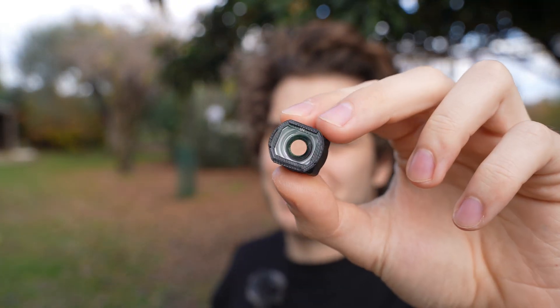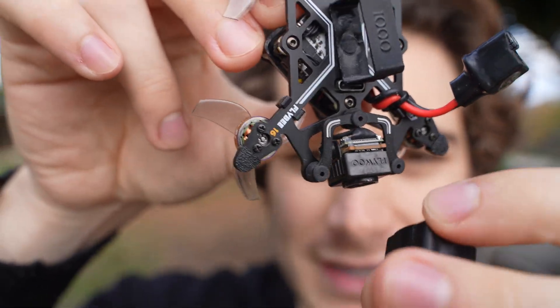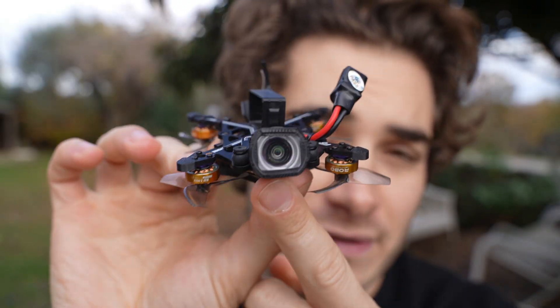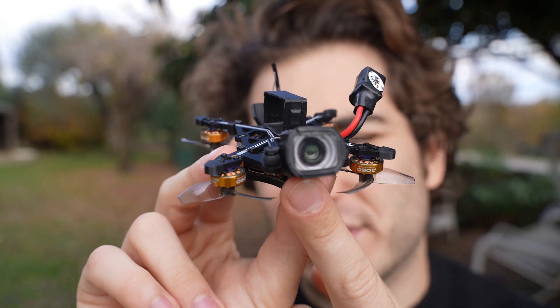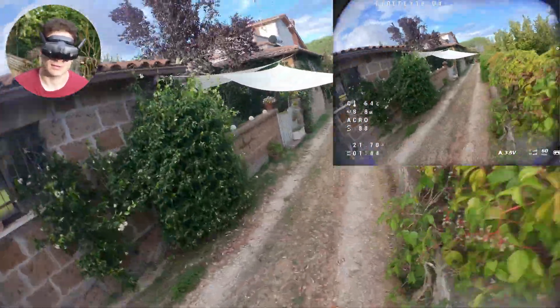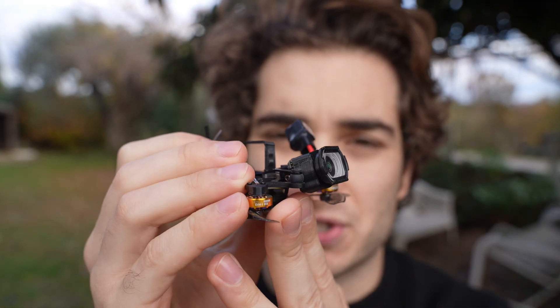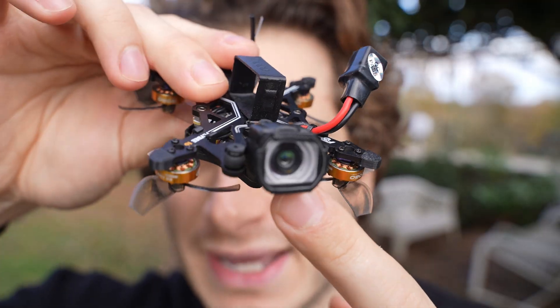FlyWoo already tried coming to the rescue earlier this year by creating this 3D printed wide camera lens adapter that slides on the FlyWoo mount for the O4 light, giving you 155 degrees of FOV. I made a review about this accessory a couple months back and found it was working phenomenally — the wider field of view was incredible — but it introduced a couple of issues. In 4x3 aspect ratio you can see the edges of the lens, and stabilization can show a black border in corners. Also, facing the sun causes light artifacts from stacked lenses, and it looks like a DIY project rather than a finished product.